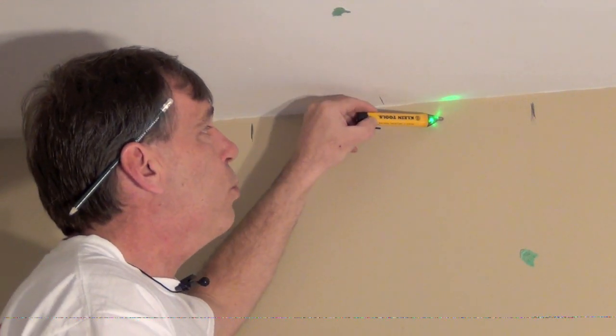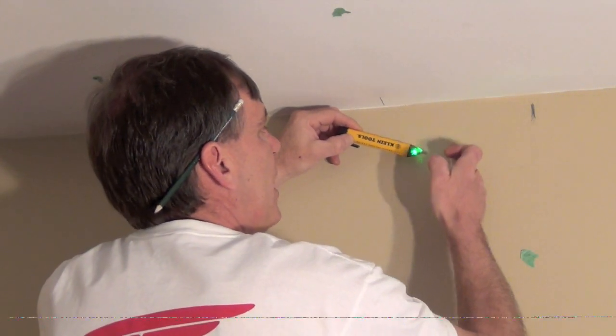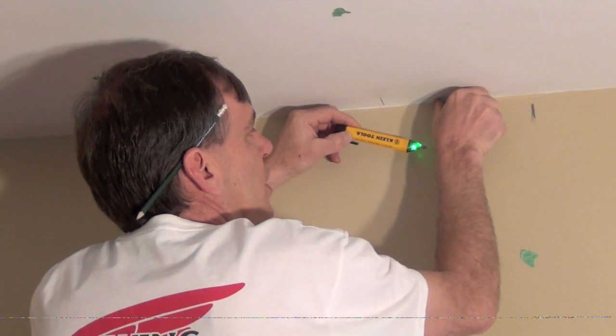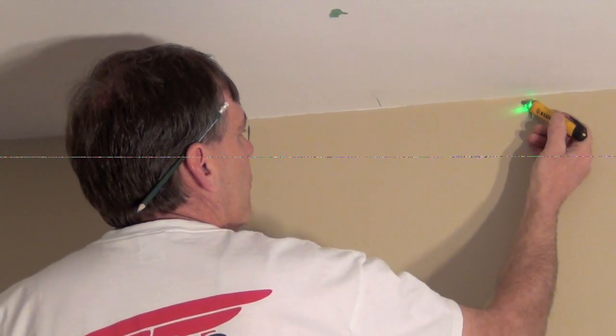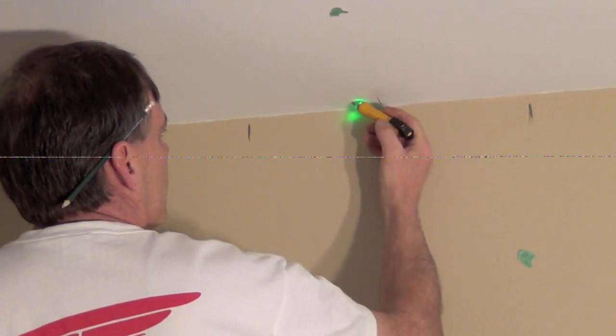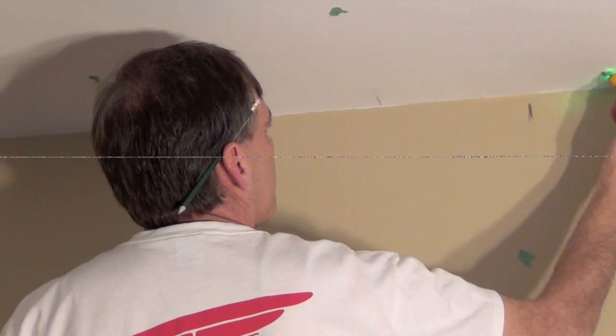Sometimes it's going to be right behind the surface, or if there's a furring strip here, they'll actually notch that out, tack their wire below the surface of the plaster, and a plaster will come in, or drywaller, and we'll finish over top of that. I always run my voltage tester around these walls to see if there's any way, and even on the ceiling, to see if there's any way an electrician has a wire buried right in there.